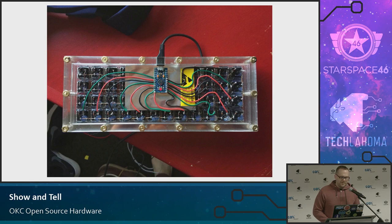Basically you connect those in this orientation. I used the QMK keyboard software, went to the Plank keyboard in that software, and had to choose where I put the columns and rows on my Pro Micro, and remap that. And then it just worked.